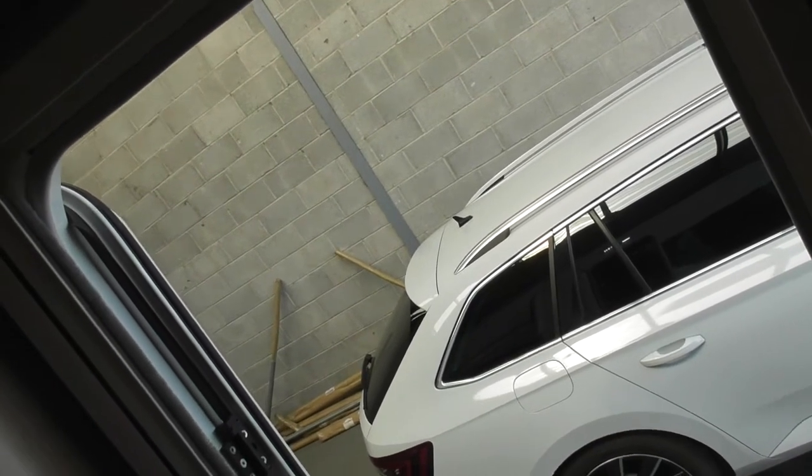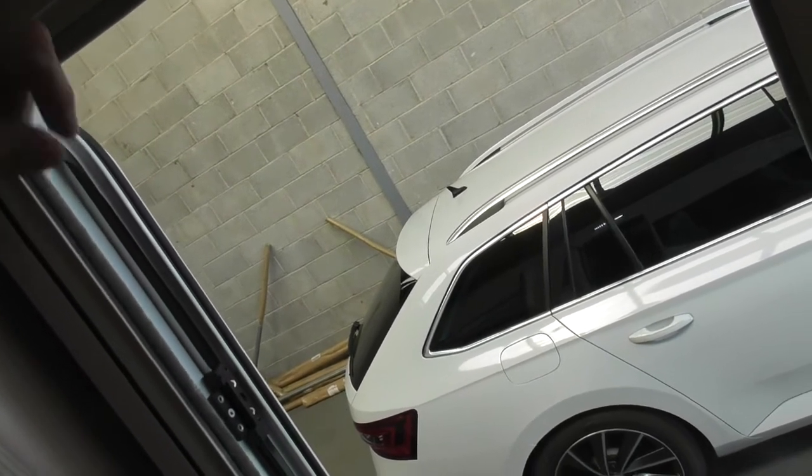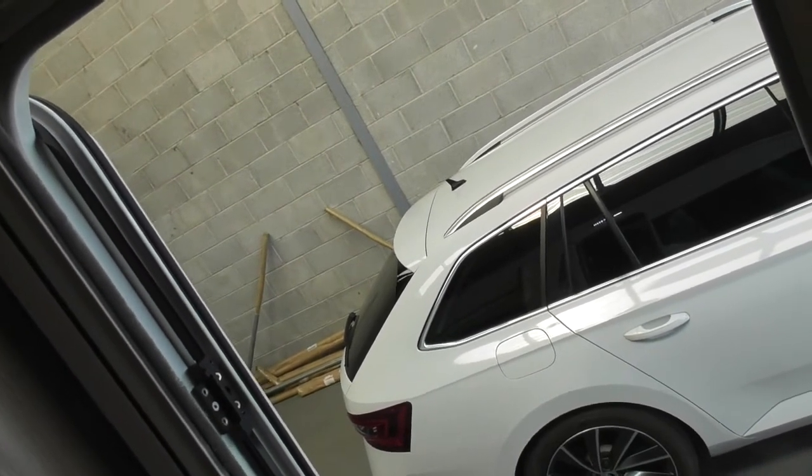So there we go. The pump's on at the moment, so circulation heating is on. That's because I've set it to 22. If you want to turn that off, just drop that temperature lower, to 19.5. Yeah, that's it. You just press that. You have to keep pressing it.